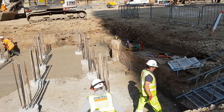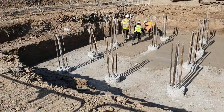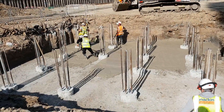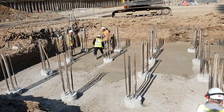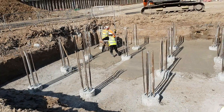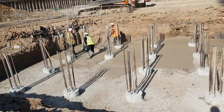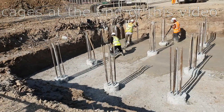That's going to be actually the next pile cap — we did that a little bit bigger to allow workers to work around it when they're constructing the steel for the crane base. That's the blinding — the guys have the level there, they're spreading the concrete and I'm keeping an eye on them. With the smaller pile caps, the lads are probably going to be using prefab cages for steel fixing — the ready-made cage comes and you drop it in position, then mark the columns on top after backfill.